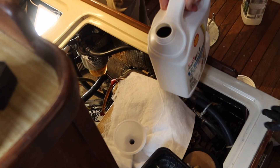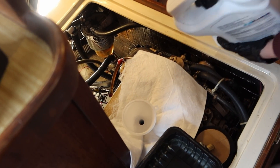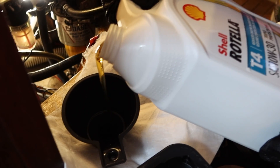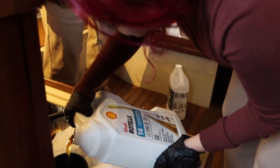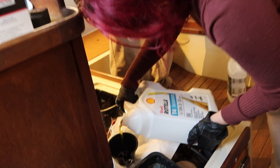How do you know it's enough? You've got the dipstick so you can check it. If you do it from this side you'll get a better angle on it. Let's use a bigger funnel. Moment of truth - maybe a little bit more. That's good, it's exactly in the middle. Yeah, so maybe just a tad more. It doesn't have to go to the top - it just has to be in the middle, because if you put too much in you have to take it out.